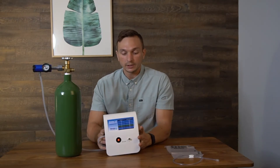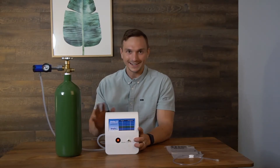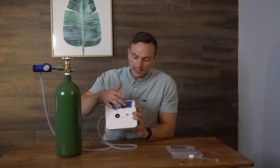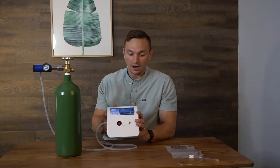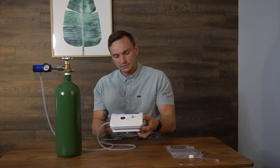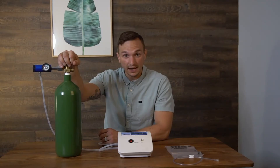On the ozone generator, there are different concentrations you can choose — these are the strengths of ozone, measured in micrograms per milliliter, or 'gamma' as a lot of people say. On this machine, the Stratus 3.0 ozone generator, we have a concentration range of 7 up to 71. Your machine might differ slightly, and that's okay. We calibrate each machine based on concentration readings here at our office to quality-assure that your machine produces the concentration it says it does.